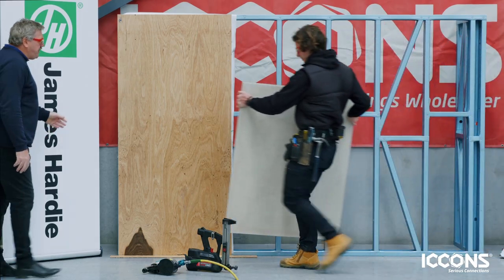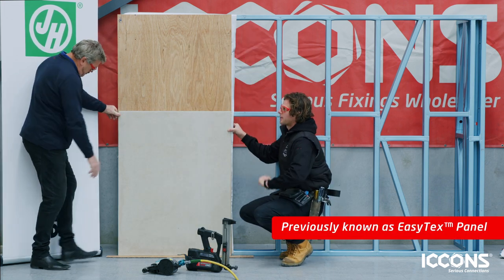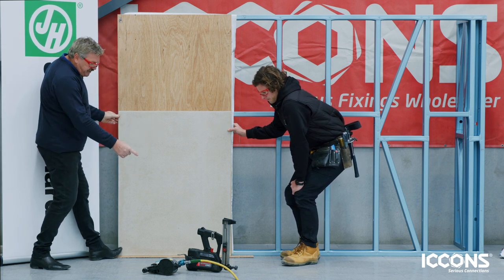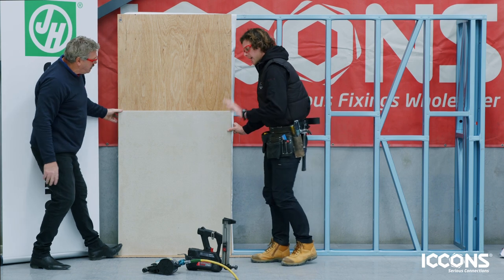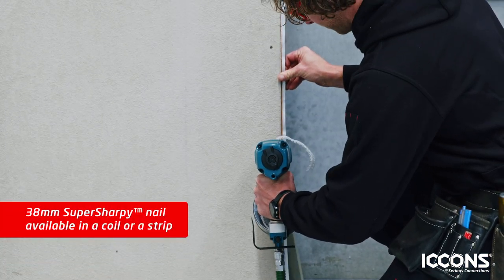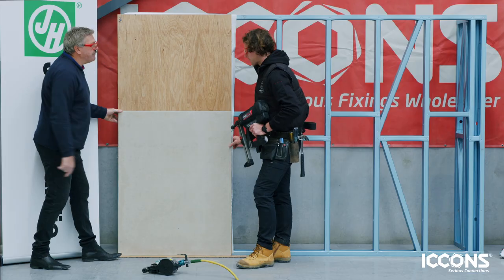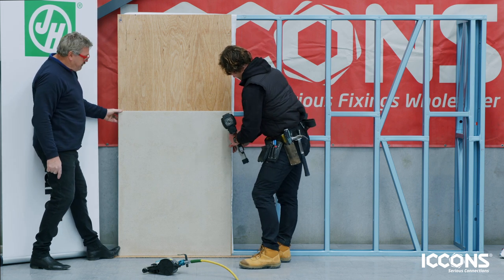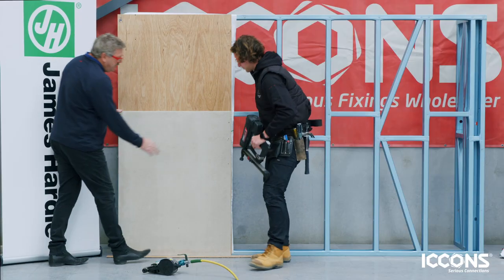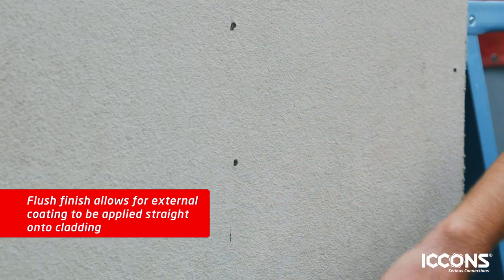Alright Pete, we've got the finishing cladding here. We've got the Hardy fine texture panel — gee that is a nice texture. For the nailing system, you can use the 15-degree angle coil nailer, but I like the convenience of a hoseless Struck nail gun. I've got 38mm Super Sharpies in this one. Gee that's a nice flush finish — beautiful finish with the Super Sharpie.